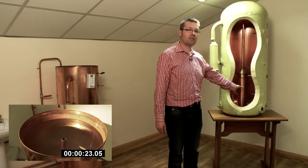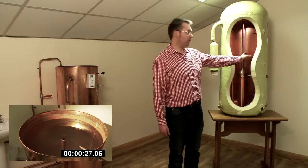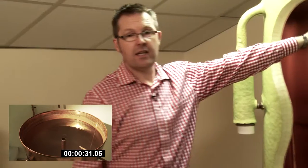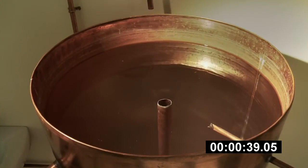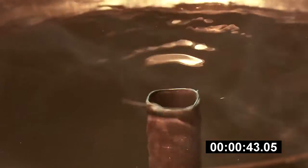As the temperature increases, the water rises through the funnel, preventing it mixing with the surrounding water, taking it close to the point of use. In the time it has taken me to explain the operating mechanism of the hothead, this rapid process has already started to work, as we can see from the plume of hot water coming out of the top of the funnel.